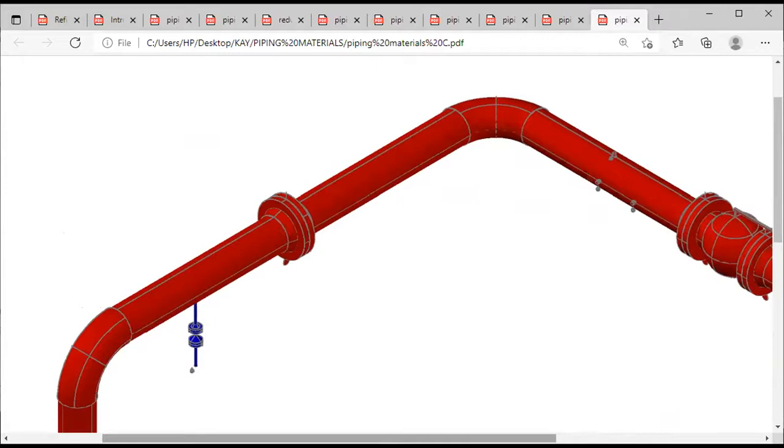So take, for instance, right now that you've exhausted one length of piping and you want to attach another length. Are you just going to bring the two pipes together and merge them together? No, the answer is no. There has to be a connector, something that will connect both pipes. And that connector that is normally used is called a flange. Now in this image here, this is a pipe. Let's assume that we have exhausted the length of this pipe and we now brought another one. We want to join both of them together. Before that could be done, you need to introduce a flange. So this is the flange here. You have a flange on the left-hand side, you have a flange on the right-hand side. Two flanges were brought together so as to properly connect the two pipes together.